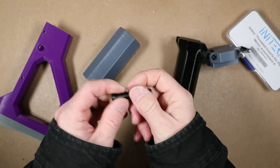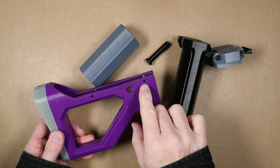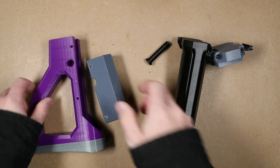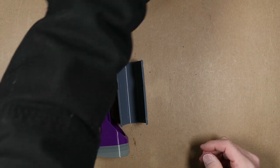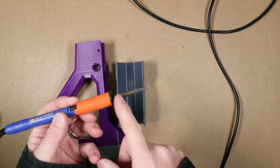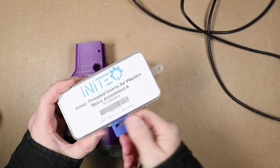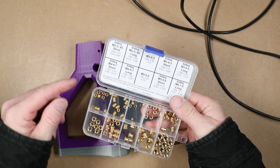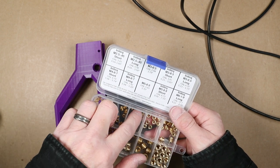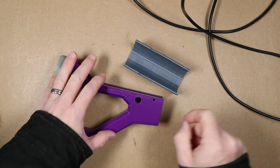So here's what's left for me to do: I got to put a couple of inserts here so we can place this on here just like that. I've got my soldering iron — this is the FM 2027 and I've got the T15 ILS, just a small conical tip. The ones I'm going to use, I'll put the links below. I'm going to be using the M3, 0.5 overall length, 2.94 — these small ones here. And we're going to put four into this.